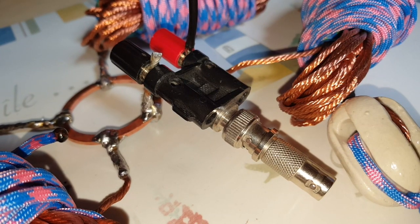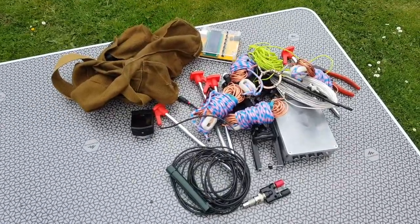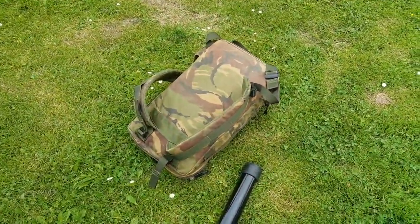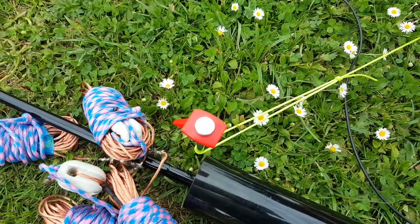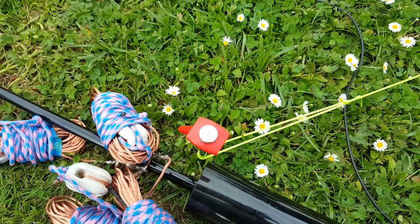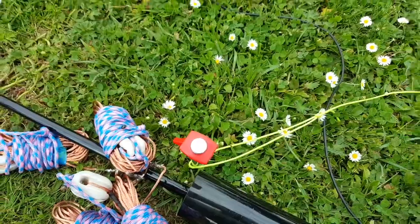Here is how the antenna will be connected to the coax with the BNC adapter. I have all my gear on the table — my chair, my mast, and the Clansman PRC 320. The mast goes through the copper ring, and the radials should be at seven meters from the bottom of the mast. I have a piece of string that's seven meters long, and I'm going to pre-set the tent stakes so that the radials are at a 45-degree angle.